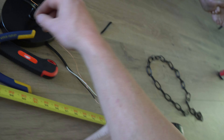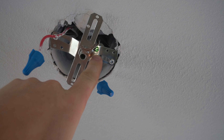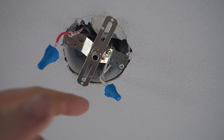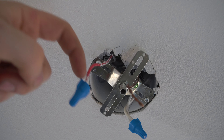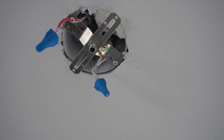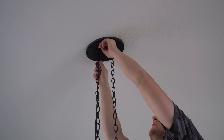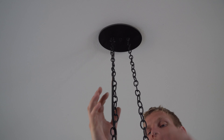Now that we've got all our wires done, we're going to re-hook this up and then go to the ceiling. You'll see this nub here — unscrew it. The little metal plate falls off the back end and you're going to take it to the roof. If you have a box up top, you will mount it like so. You can ground this plate by running a small piece of copper wire from here to right here — this is advised for most, but a lot of people don't do it. Run the bare copper wire to there. If you have a red wire, put your black wire to the red, or if it's black, put it to black, and white to white — just tie them back in. When putting this up, hold the plate up onto here and tighten it. Put as much wire as you can in here and then pull what you actually need out so it stays nice and taut.